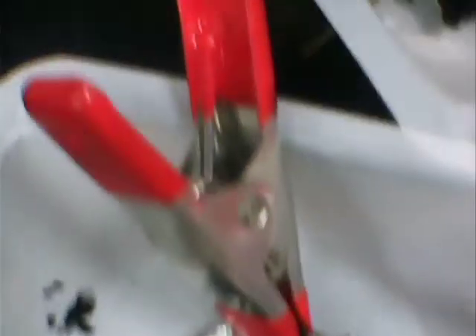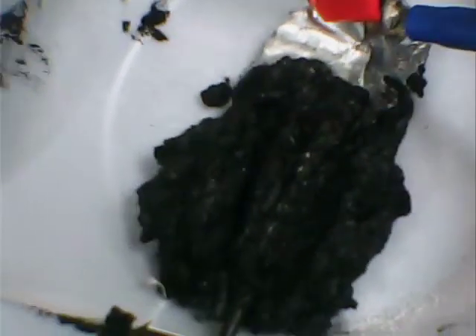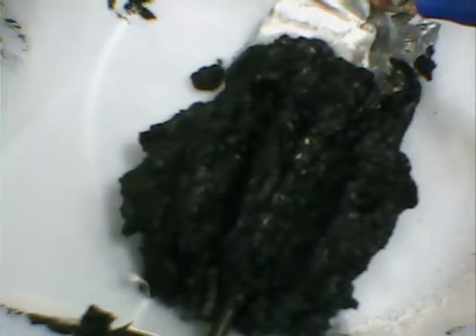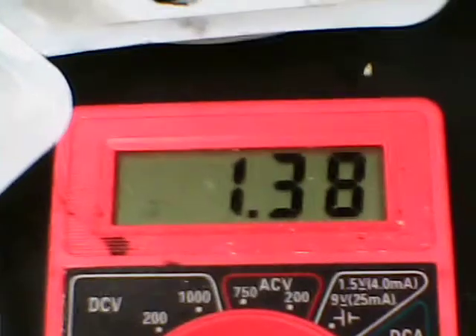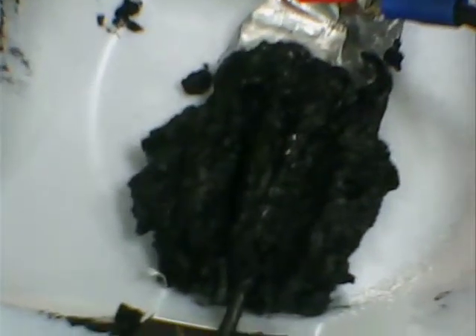So what I have is the zinc, and I've got the manganese dioxide under alkaline conditions with the gel, and that is coated on the outside of that membrane. I'm getting 1.38 volts. What I want to see is how the internal resistance holds up. I have a meter for that, and I'll be uploading YouTube videos monitoring the internal resistance, which will give me an indication of whether this paste gel polyelectrolyte will work.